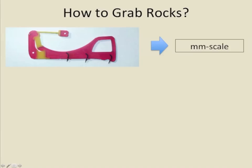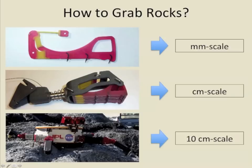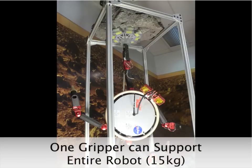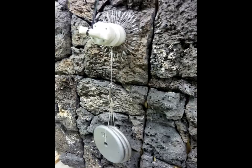Using hierarchical compliance, microspines can conform to millimeter-scale roughness, carriages can conform to centimeter-scale, and the robot's limbs can conform to 10-centimeter-scale. A gripper can support 150 newtons, or 35 pounds, in any direction on rough volcanic rocks, and supports 50 to 75 newtons on semi-rough or friable rocks.